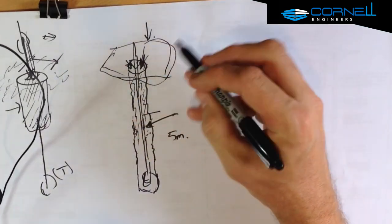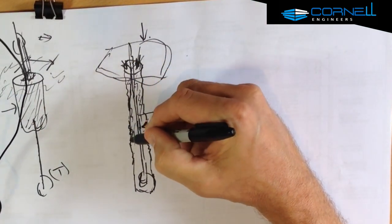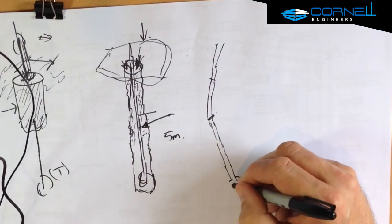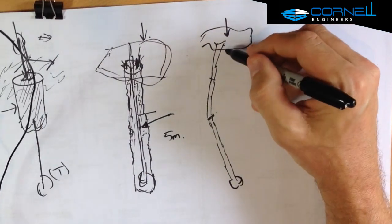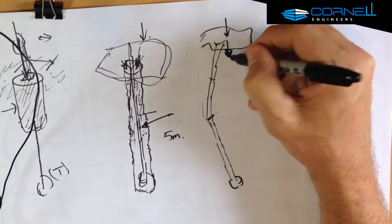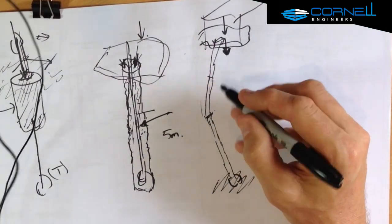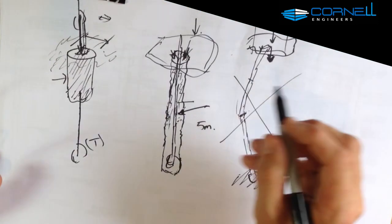To help you picture it, here's what a buckled screw pier might look like. Once it buckles and pushes sideways, those connections may be fairly stiff, but once it tilts sideways, the load being placed on it at ground level is no longer being properly taken by the screw pile. It might end up touching the sides and eventually stop, but we're going to experience vertical movement at the top of the screw pile. The purpose of the screw pile is obviously to not move — to support our foundation on something good and stiff — but if it flexes under load, it's not doing its job. For me, that's a fail.